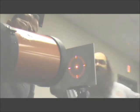Okay, yeah, my scope was... Now the thickness looks... come here and look. Looks better? Looks like the thickness is more uniform? Yes, it does. Converged lasers on the reflector mirror are also centered on the small bullseye target. If not, the secondary mirror is still not positioned correctly in the primary optical axis. The whole ring looks pretty consistent almost all the way around.